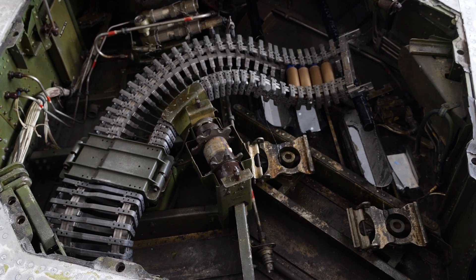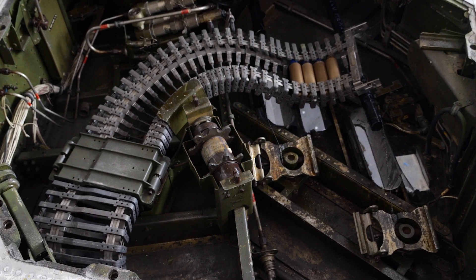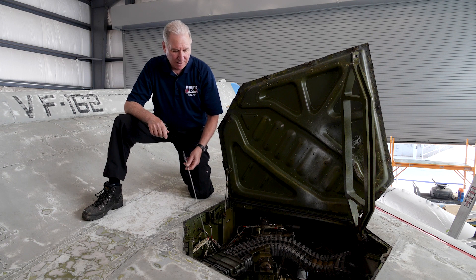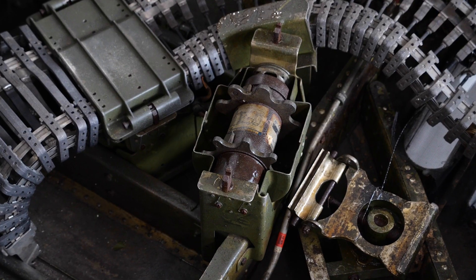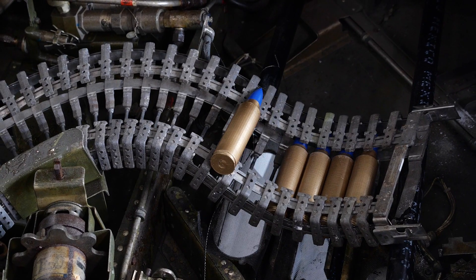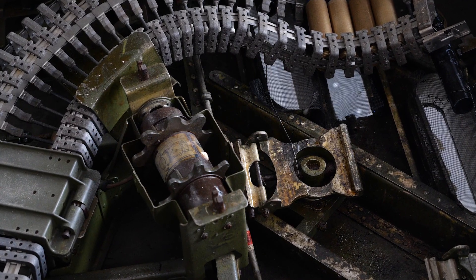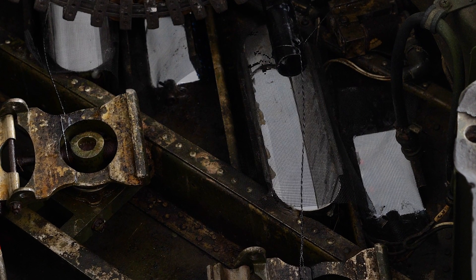What we have done here, we placed in one of the bullet feeding mechanisms with the guns being in their position. This would feed when the pilot were to want to use his bullets — this item would rotate and place the bullets into the gun. Right here is where the bullets would eject out of the airplane, and on the other window is a cooling vent for the guns.